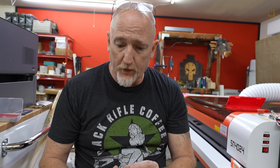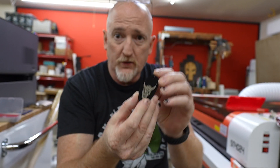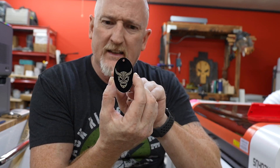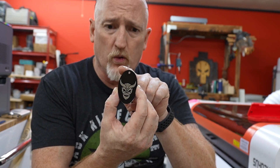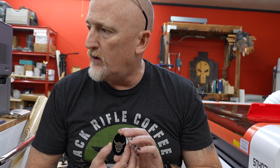And just to show off that it can do both at once, I went ahead and engraved on this acrylic with the IR and then cut it out with the blue diode. I had it open so you guys could see it better on camera. It smells a little like acrylic in here, but that exhaust fan sucked that out pretty good. This one took the longest — the cut is 2 millimeters per second and it ran in right under five minutes, at 4:23. So all of these projects ran about the same amount of time, aside from the emergency card which was super fast. It's a powerful little thing.